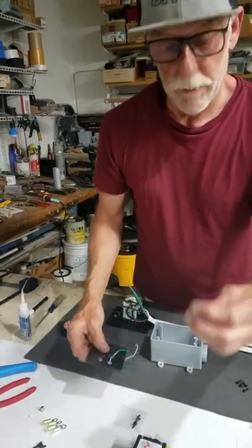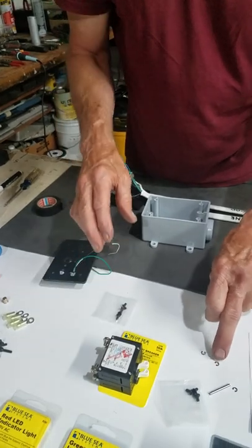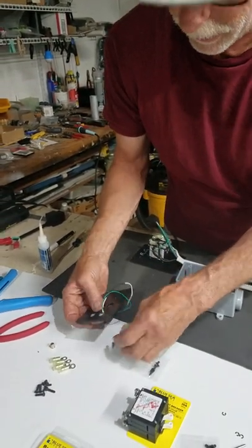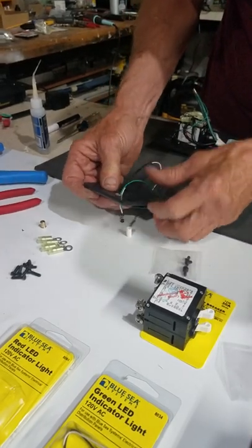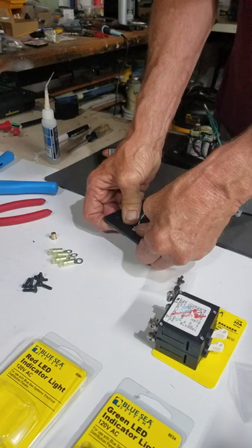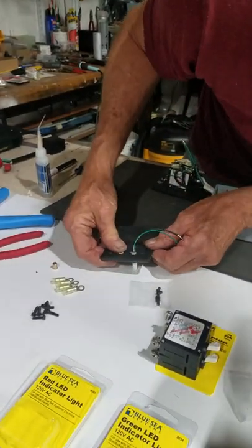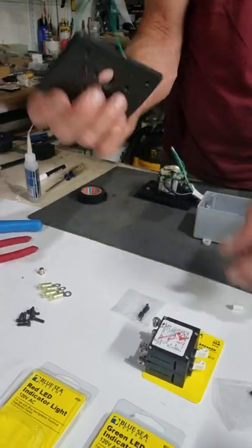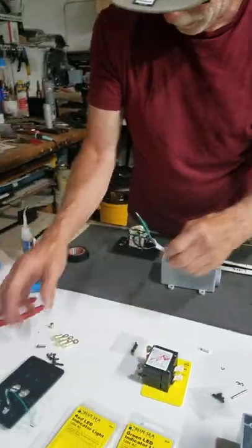You just kind of pull the wires through. There's a little white sleeve that goes between the two poles of the breaker — it installs with pins and a couple of e-clips. You can use that spacer to push the LED in. Put the lens of the LED in, lay it on the table, and then push the LED through. Using that little spacer around the lens allows you to push the LED through. That's a really easy step, and both LEDs get installed this way.